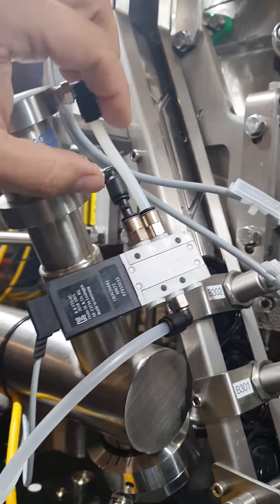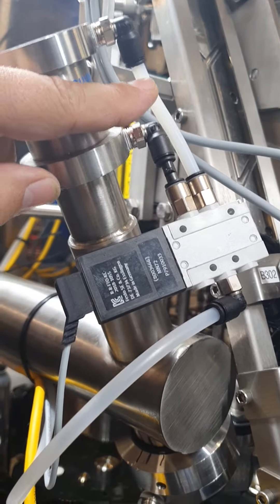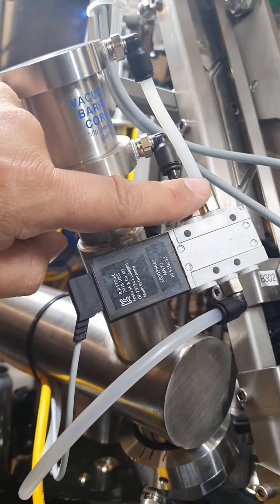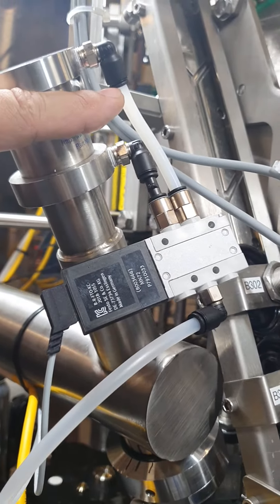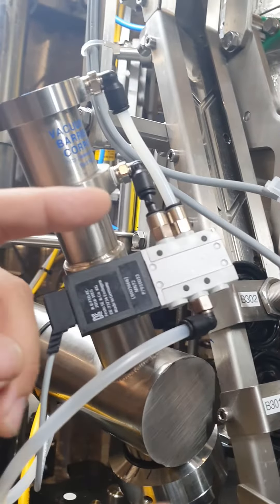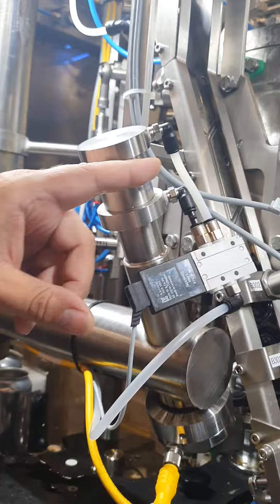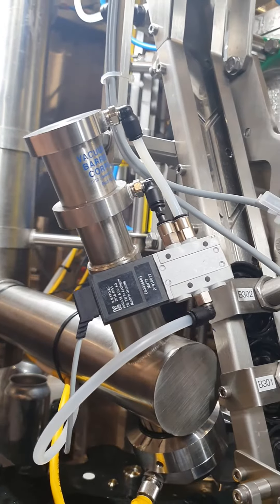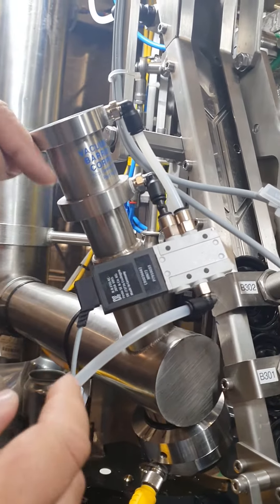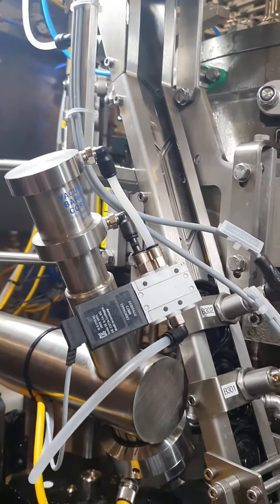Because the compressed air is dispersed very quickly with a short distance. But if you double it and make a long length of PVC tube, the compressed air needs more time to push the valve. So that's why we need this short length — very important.